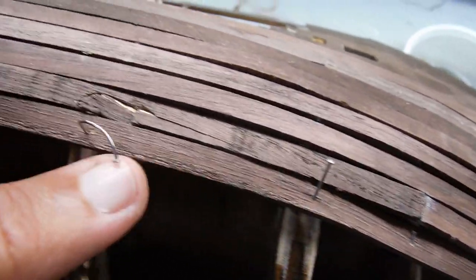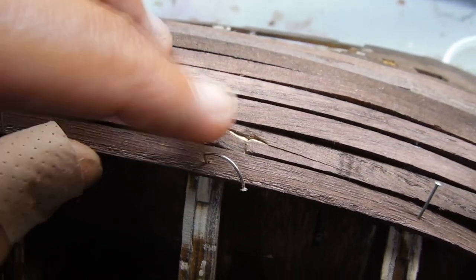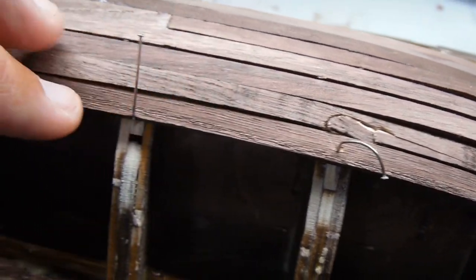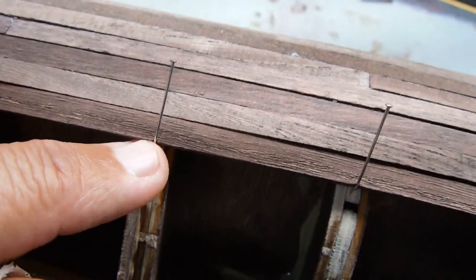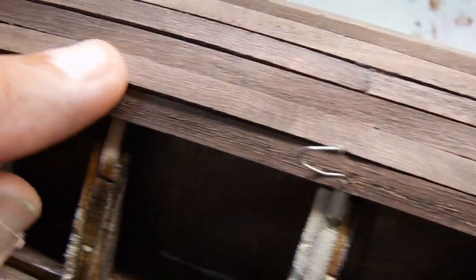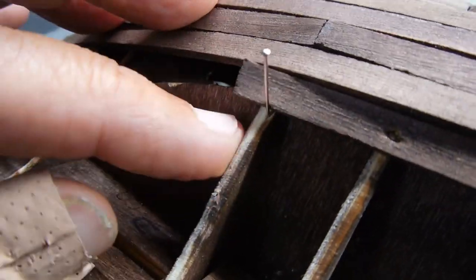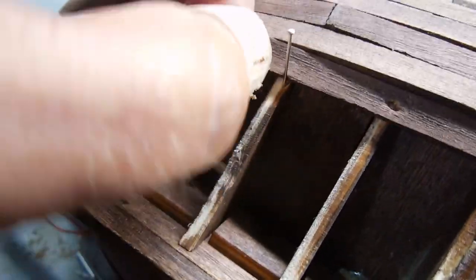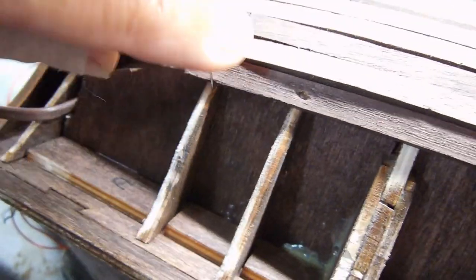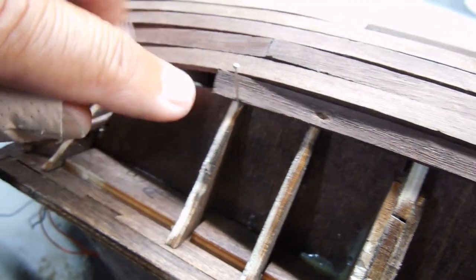As you can see, this is the place where I went in too far. Along here I did better, though my tool slipped and kind of cracked that piece of wood — I'll fill that with wood putty and sand it off. Some went better than others. The good technique is going off to the side, down below, and slanting into the board to hold it in place. One I drove all the way in and it pushed too far, but again sanding or putty will fix it. The technique I like best: go in below the board, holding it up, and I'll trim it off along where the framing is so the next plank can also rest on that frame.